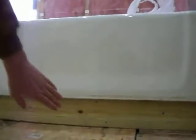This video is actually about some more work on the bathtub and getting that squared away. The bathtub, if you'll remember, has been raised about 5 inches above the floor, and that is to allow the drain pipes to sit proud of the floor so that I don't have to put a notch in any of the floor joists that I spent repairing. But there are issues with that.